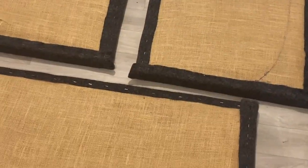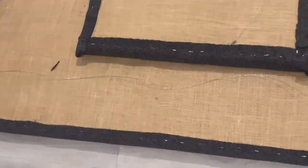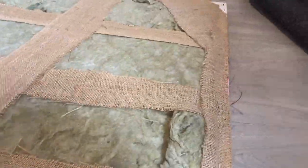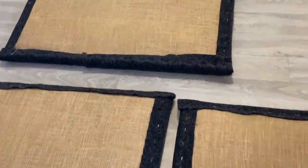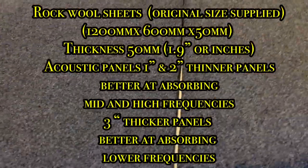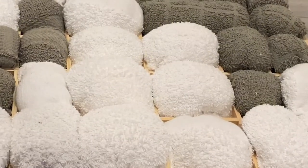That's what the back of the acoustic panel looks like once you're finished — you can see the back cloth or burlap and the ribbons have been fitted properly. This process is open to improvisation: if you've got picture frames you can use them or canvases. If you've got extra bits of rock wool, you could get strings off your burlap to keep them in position. Get the front cover, staple it on, and that's your acoustic panel sorted. If you flip the acoustic panels 90 degrees you can see it looks a lot more aesthetically pleasing compared to the more cost-effective burlap sheets. Whatever budget you're working to, you can always work your way around the panels.